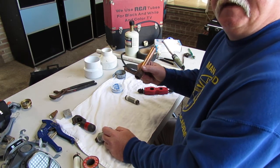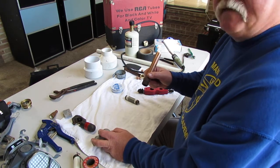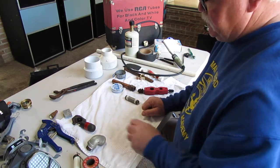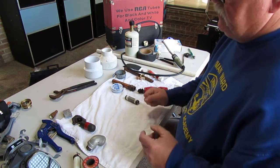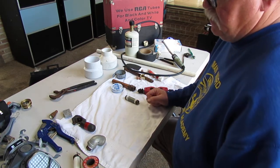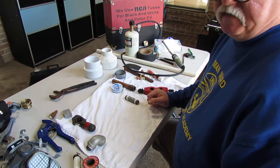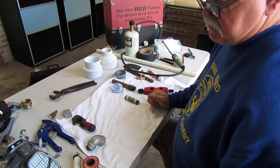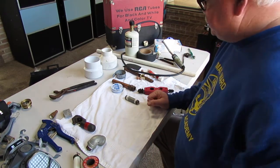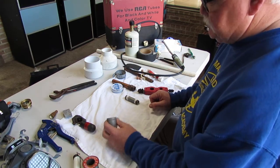If I was building a house right now on a slab, I would actually want copper in the slab — I would use Type K for that. The reason I like it is I used to plumb a lot of houses with Type K copper in the slab because it's really malleable and can go along with the expansion and contraction of the concrete. It's also really thick — that's essentially what the Type K schedule means.